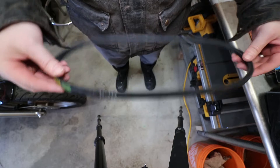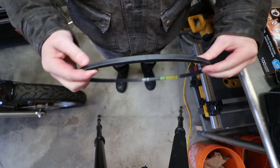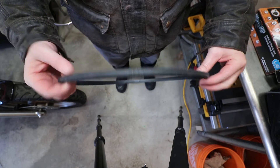This particular furnace's blower is direct drive. If your blower is belt drive, the belt should be inspected. It's best to slide the belt over the pulley and remove it to inspect. Flip the belt inside out and check for cracks or splits.